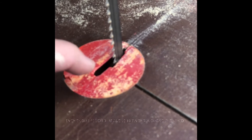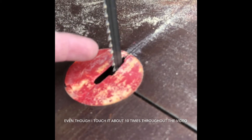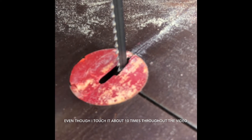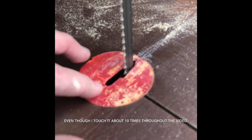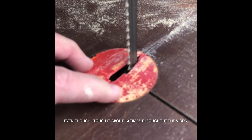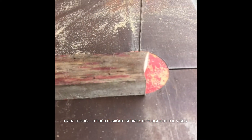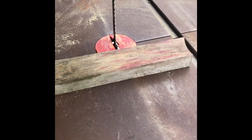I'm not touching the blade — not that silly. But a thin piece came off and wedged down between the plastic insert and the blade and broke the insert. I don't really like that plastic piece, but it's probably operator malfunction more than equipment malfunction. I do think they should have made it more sturdy. If you're cutting off a small piece, that's an opportunity for that to happen, but if the material is resting on the steel on both sides, it's not likely.